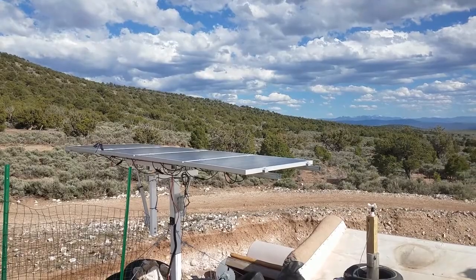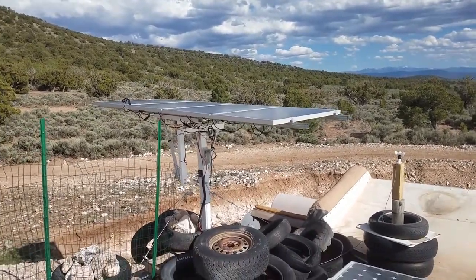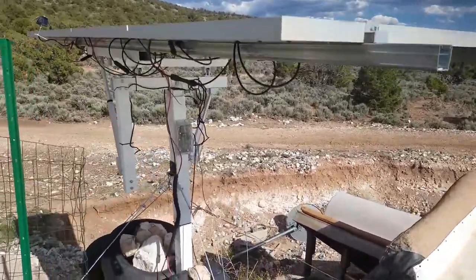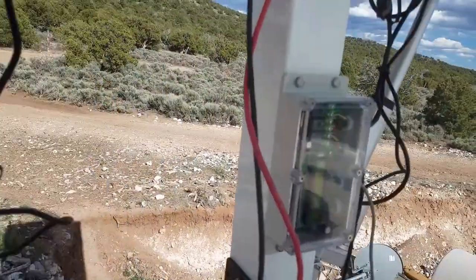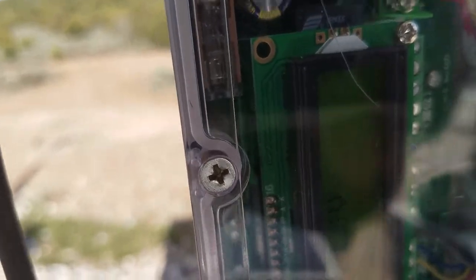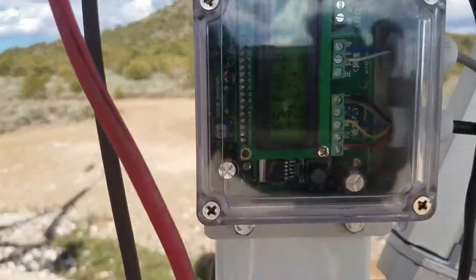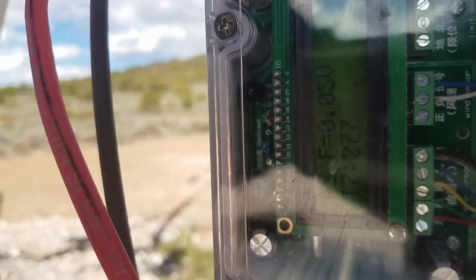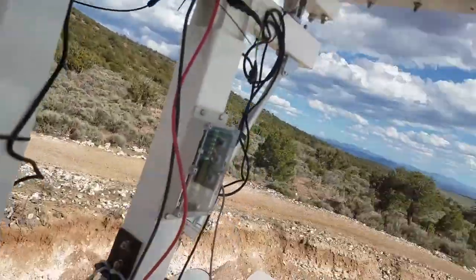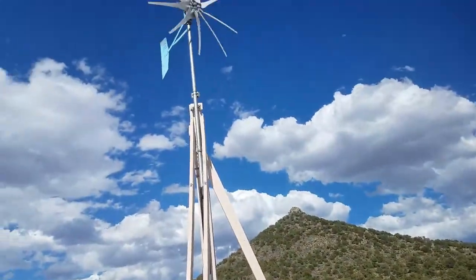That is flat now and should be pretty safe from the wind. It has a 300-second timeout — there is a 300-second countdown going on right now and it will wait those 300 seconds before returning to normal operation. If the wind speed doesn't drop and continues to trigger that threshold, it will reset that 300-second timer every time the wind goes above the threshold.